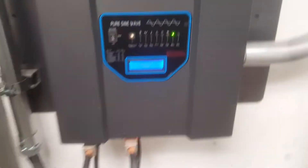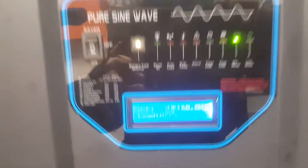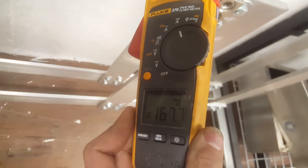What is up YouTube, Hitech Club here. Today I have this inverter at 77% load. I've got my amp meter clamped and I am at 170 amps. This is around the two parallels of 3-Aught wire.